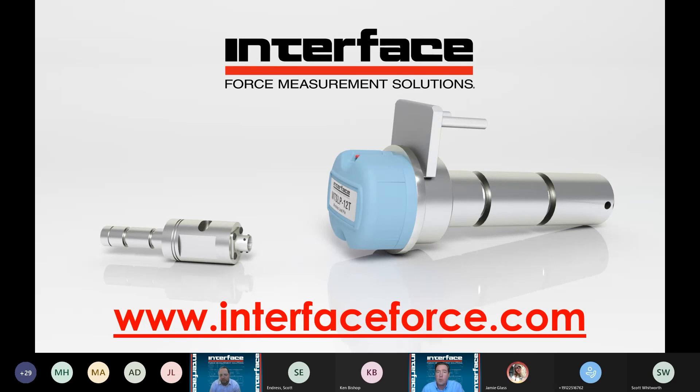Ellie is asking how many amplifiers with 4 to 20 signals can be in one pin. We've certainly done dual bridge. A 4 to 20 on a dual bridge is no problem, or a biaxial would be no problem as well. It depends on the geometry and somewhat on the diameter of the pin. We've done up to four bridges thus far.